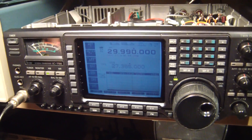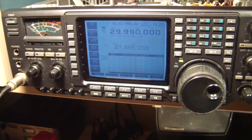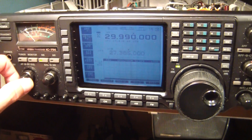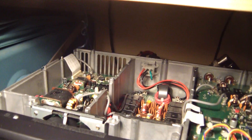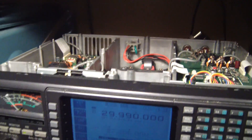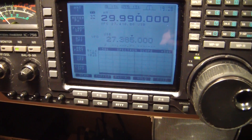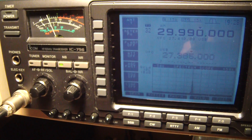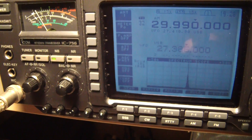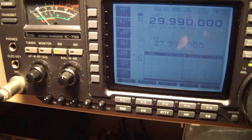She's all powered up and I'm sorry to say the results are negative — no change in symptom. Let me show you again what that is. I'm on AM mode here, turned the volume up a bit. I do have a dummy load hooked up and I'm running at about half power on the output. So this is AM mode and I'm looking at the power output on the meter. There's that interference again. I switch over to sideband — no audio.